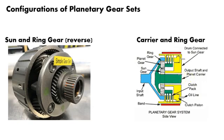So the benefit of having your stationary gears, your ring gear, or any of the others for that matter, is dependent on what you're trying to get that particular gear set to do. So now those are both gear sets, and they both have sort of a dedicated ability. So what do you want to do? So what happens when you want to have a more complicated system, more complicated movements? Well, now you have to deal with multiple gear sets, put into series.